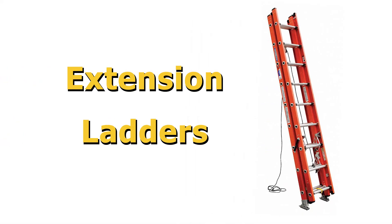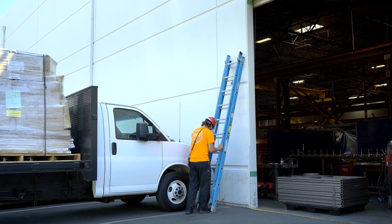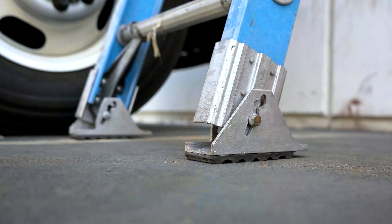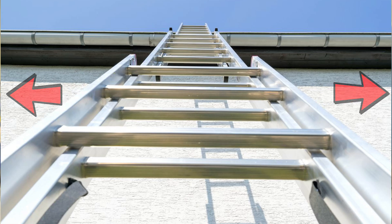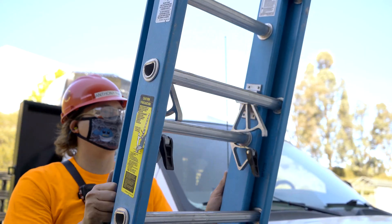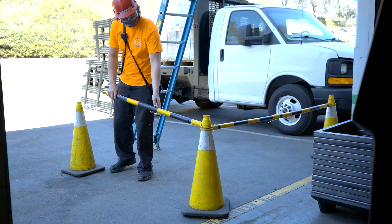Let's move on to extension ladders. The extension ladder consists of two or more sections that travel in guides or brackets arranged so you can adjust the ladder's length. They are used to lean against tall structures or walls to reach elevated locations. To use them safely, you'll need to make sure the ladder is stable. Before placing your ladder, check that the floor and the wall the ladder will lean on is flat, even, and not slippery. Keep in mind that backwards and forwards are not the only direction a ladder can fall — they can also slide left or right, so check that the ladder is stable in all directions before climbing on it. Next, make sure that the locking section of the ladder is secure and will support your weight when using it. For jobs in high traffic areas, place a barricade around the ladder to keep it from being knocked over or bumped into.